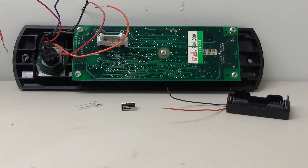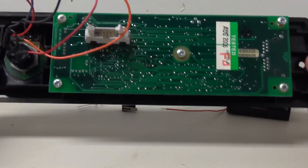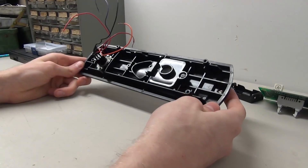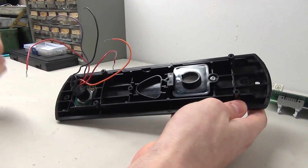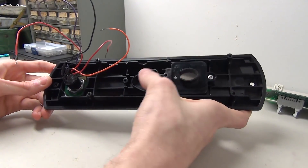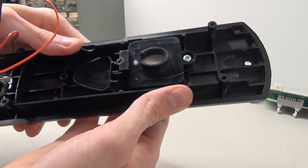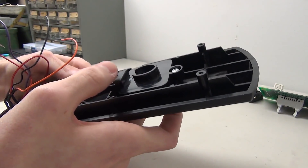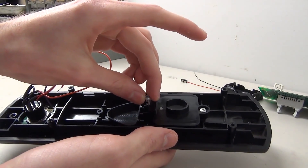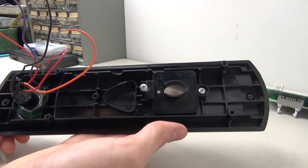Once you've acquired all the parts, we'll get started disassembling the original elevator part. If your part has the circuit board attached to the back, we're going to take that off - but make sure to leave the key switch on because we are going to use that. Once you remove the board, this is what the button looks like underneath. You'll notice the opening for where the light would go through and a little plastic piece which pushes up on the button. Save one screw because we're going to tighten it down to hold that plastic piece in place.